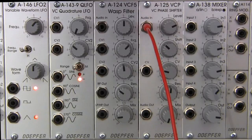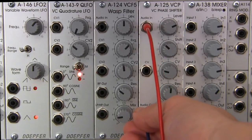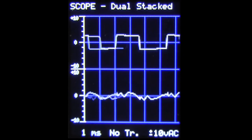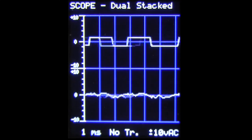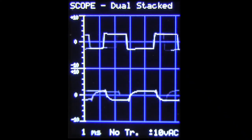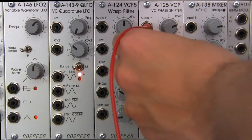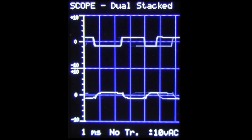Now I'm going to take this third multiple and go up to the phase shifter and feed it our dry signal. So now you understand what we're actually looking at over at the oscilloscope is our dry signal so far. Now we need to send the phase signal over to the oscilloscope as well, so I'm going to patch this cable into the second input of the oscilloscope. And you can see immediately that our square wave has already been transformed quite a bit at the second input.